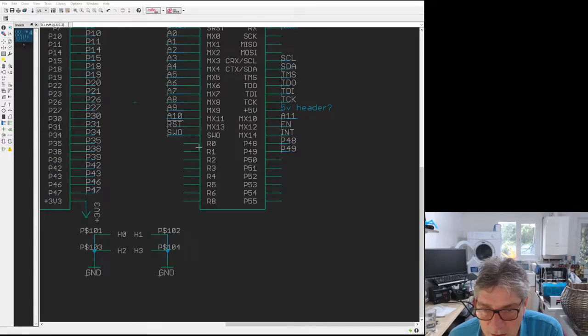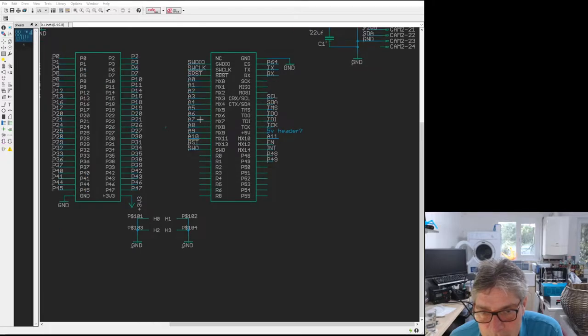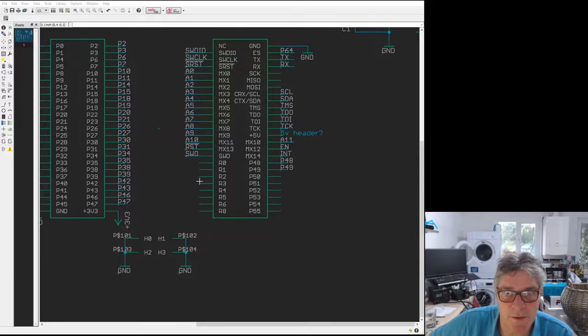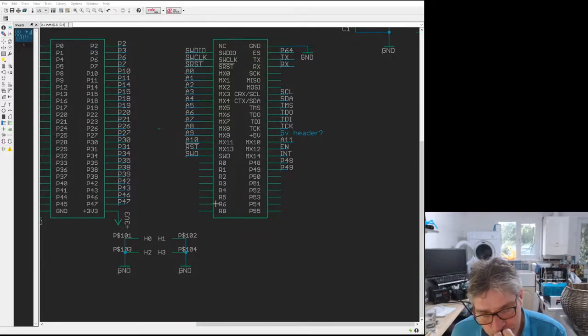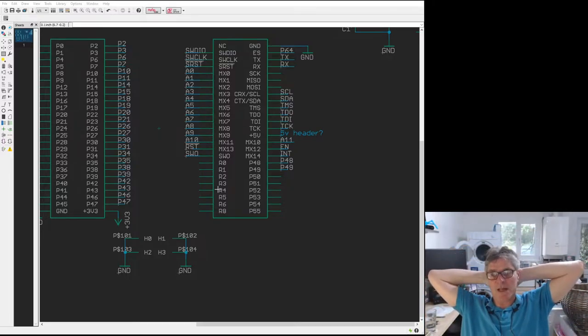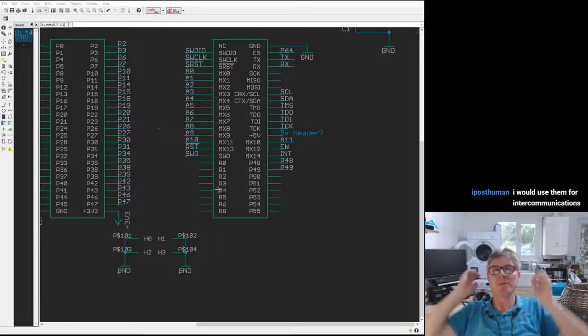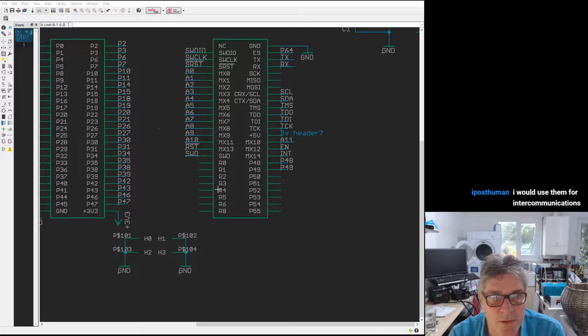So what we're talking about, IPOST, in case you've forgotten, is if we did a black edge version, we've got an extra 8 reserve pins here, which we could have IOs on. And potentially add these 6 in as well. And the question is, what could we use them for? Should we pin them out? I think we should, if we wanted to go the route and add an ECP5 black edge option for this carrier. Yes, so display purposes is quite an interesting one, I think. However, there may be a problem because I think those 8 signals by themselves, as on a current ECP5 design, would be low powered signals.